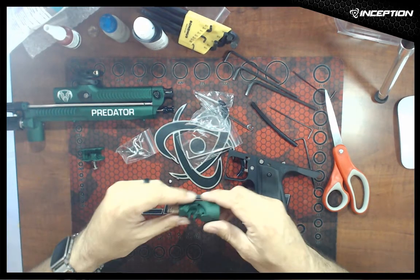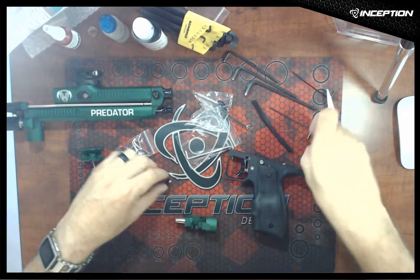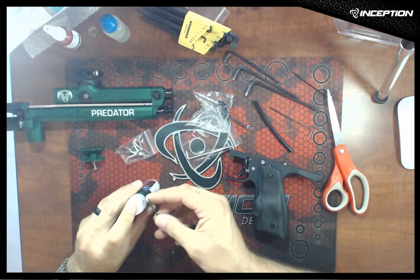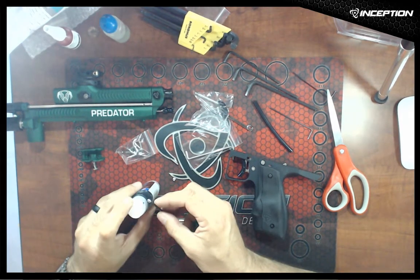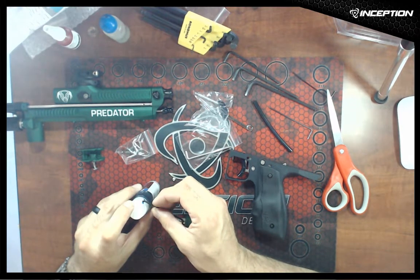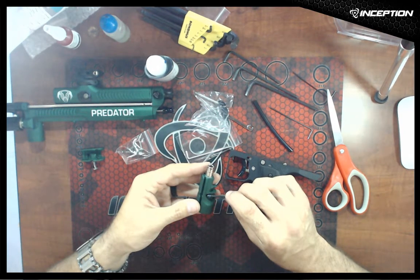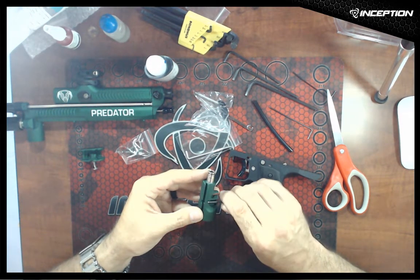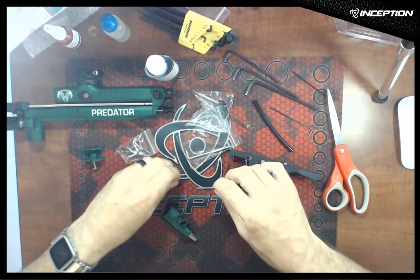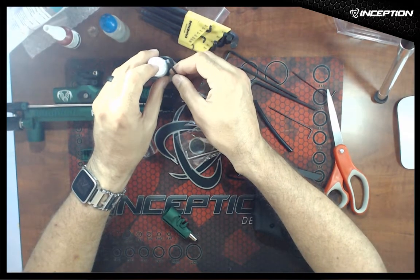In the main body of the ASA we're going to take our little set screws and apply a little blue loctite again — just a little drop, worked into the threads. There are two 1032 holes on the ASA, so we're going to bring those set screws in there. Make sure they don't come up above the sliding surface yet — we're just installing them into the ASA.